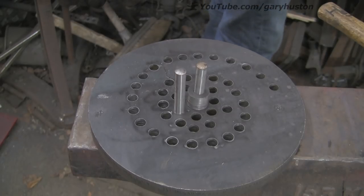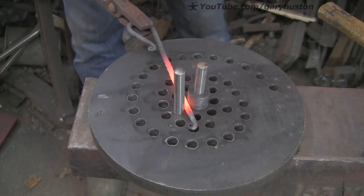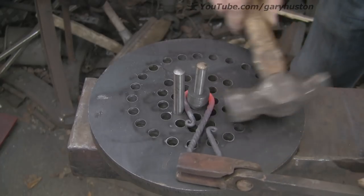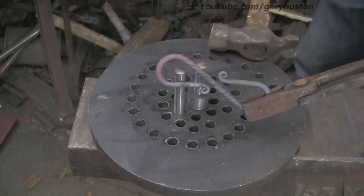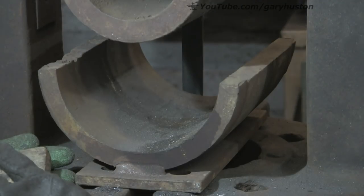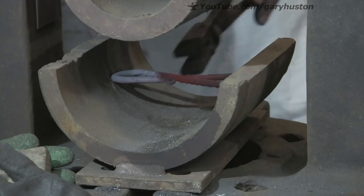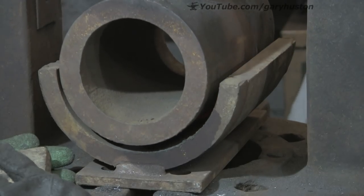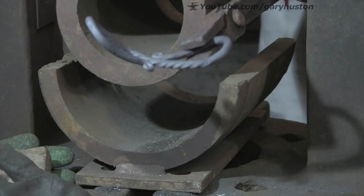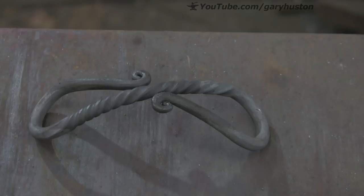There we go, and we do exactly the same to the other end — just give it a little tap round, just to keep it tight onto the jig. Nice. Now I'm going to put the bend in the other way and I'm going to use the fly press — might as well use the tools you've got. This will give it a nice even bend, stop mucking about on the anvil trying to get it right. Just give it a little bump, get it out and show you — it looks a bit funny but it will be a nice even bend.